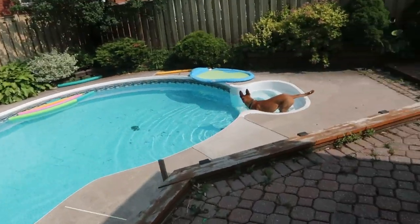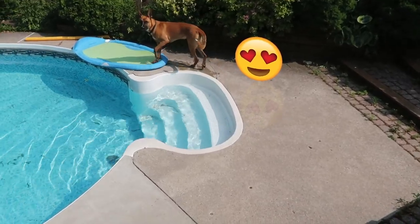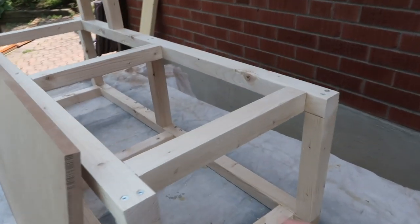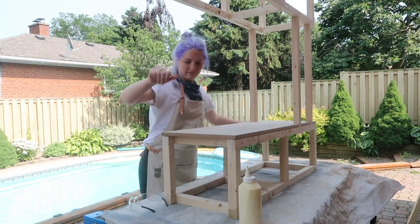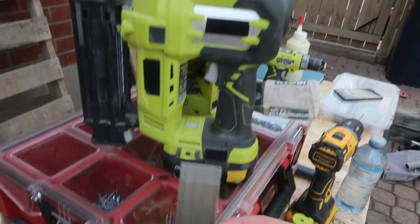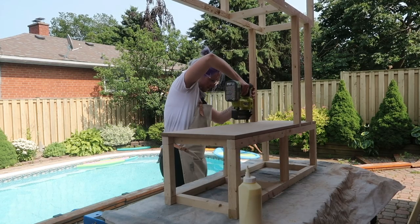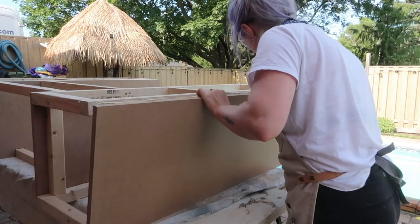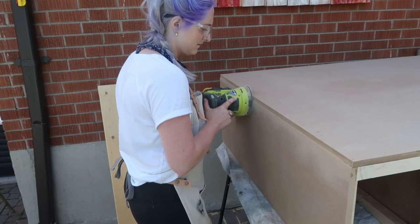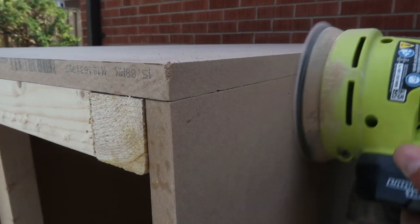We have Doggo in the pool — I wish I could join you! Now that we have our side pieces, I'm adding wood glue to all of the flat edges, popping it down, and using the brad nailer with a 2-inch brad nail to secure it nice and fast. I worked on each side of the fireplace until all my sides were on. Then, using a palm sander, I sanded down all the edges so they looked uniform and smooth.